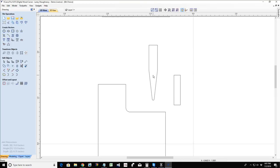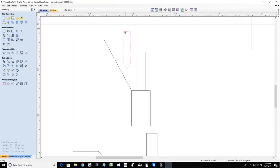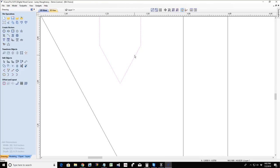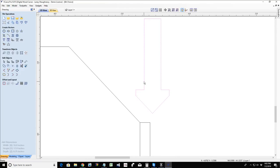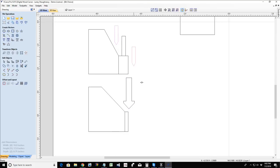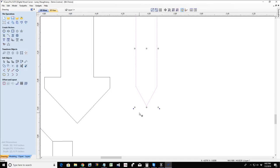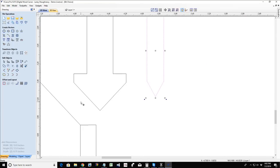Okay? So you want to make sure that you're calculating your toolpath with the exact bit that you're going to be using. If I calculate a 60 degree 0.25 V-bit, meaning the shank is 0.25 and it comes down to a point like the Whiteside 1541, but I'm using my Amana 60 degree V-bit that has a 1/2 inch head, those are two completely different looking bits. So it's going to calculate things differently. Even though the angle's the same, it's going to calculate the toolpath differently based on that bit and the profile of that bit. Okay?